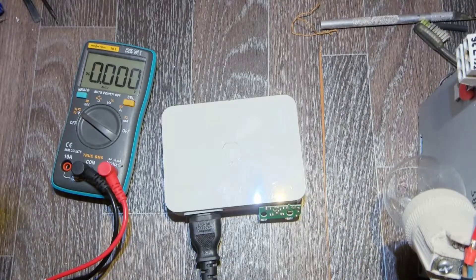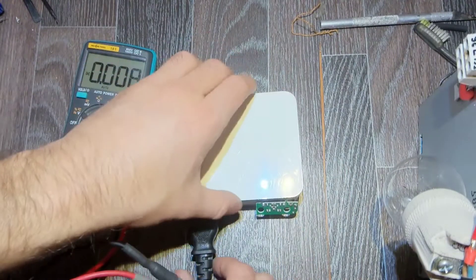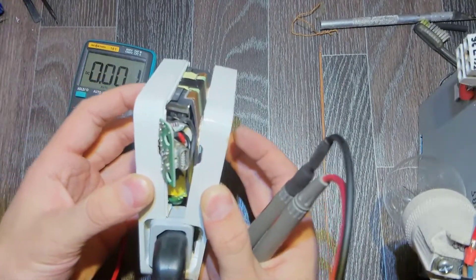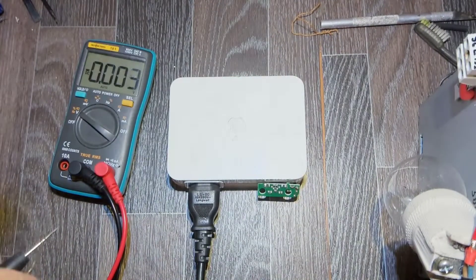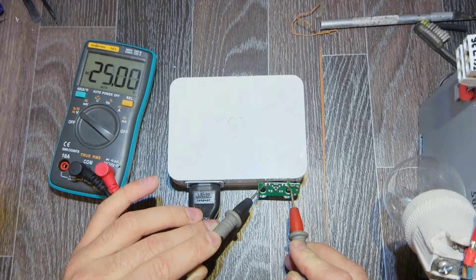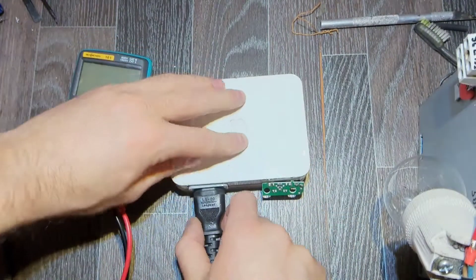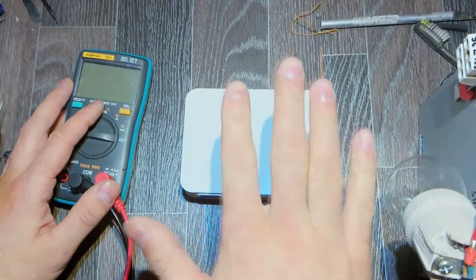Now I'm going to put everything back as it came. I put everything back — this board is out just for checking. I'm not going to glue it; the man would do that himself. I just want to make sure everything still works. Turn it on — the lamp hasn't blinked because the main cap is charged — and we can see 25 volts. This one is fixed. That was an easy fault, unusual. See you next time, bye.